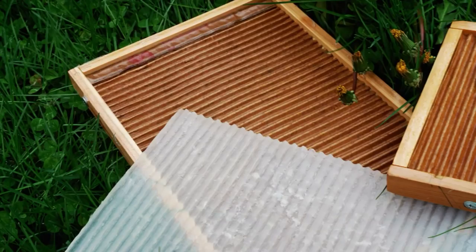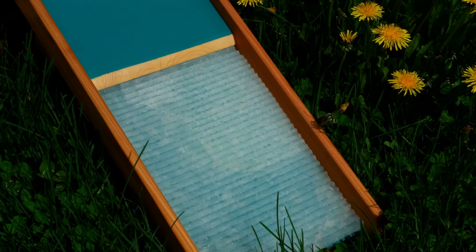This ended up giving me a real nice mat I could use for my new sluice. It has some nice, deep, gold-catching riffles that are a lot better than the commercial versions, and the silicone seems to hang on to the gold a lot better than rubber. This is how it's looking in my new sluice — to see how it's working, stay tuned for a future video. I want to thank Alan for this idea — there's a link to his site down in the description. Thanks for watching and we'll see you again.